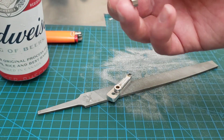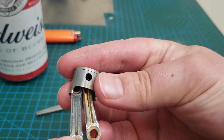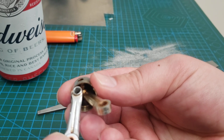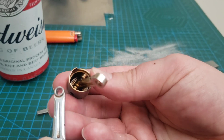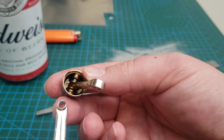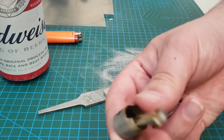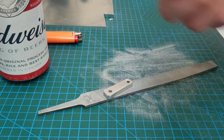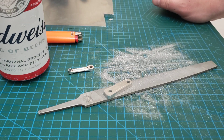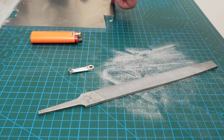These pistons — around 2010 is roughly when they changed the design. You can see what the old rod looks like compared to the new one. They put that big gouge up the center, and on the new style rod you can see the oil hole — they made it really thin there. The pistons also used to have a thicker pin boss where the wrist pin goes through, much stronger, and they never really broke — they just wore out. Until Traxxas decided to weaken them up a little bit to see what they can break and how much money people will spend before they get sick of it and go electric — but I digress.